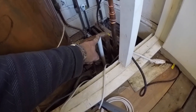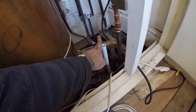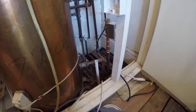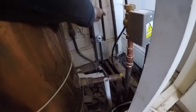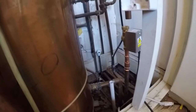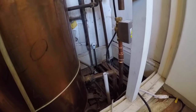I've brought up this new supply — it comes into the house in 32mm and goes across into 22mm into the kitchen. This is where it comes up to supply the bathroom and the hot water cylinder, and 22mm will do the job fine. The tanks in the loft will be redundant now, so I've cut off that one. Bathroom supply will be going through on 15mm cold and 22mm hot.